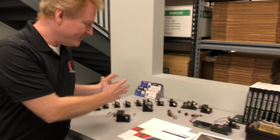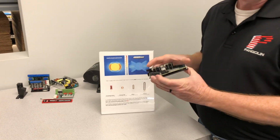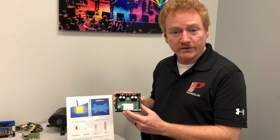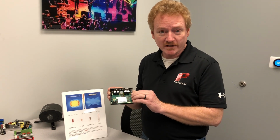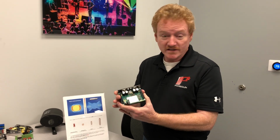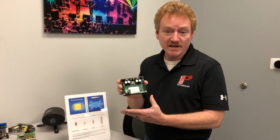And so to drive these motors and scanners, what we have is several servo drivers. One of them, and our most popular, being the Mach DSP. The Mach DSP has a floating point DSP processor running at 450 megahertz. We digitize 8 signals simultaneously with this. We digitize command, position, coil current, and coil voltage for 2 axes. So this one motor can run 2 axes, and we do it at up to 200,000 samples per second.